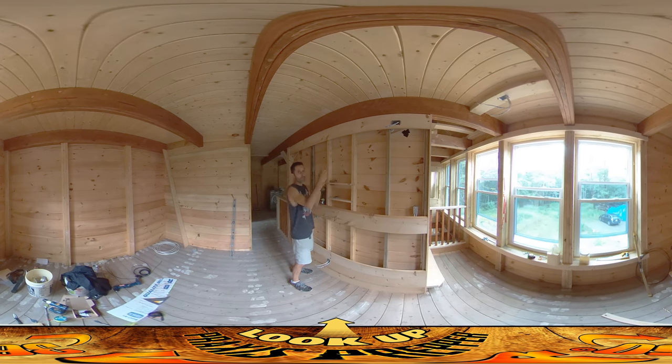You could just run a wire through the wall — one end plugged into the back of your player, one end plugged into the back of your monitor — but the reason I'm running them to a plate is because if you're ever plugging it in and bend a pin or something, the entire wire would need to be re-pulled and replaced. But if you have a static, untouched wire in the wall, you can just replace the plate or the short cable. It makes it a lot easier for when things inevitably break, because they always do eventually.